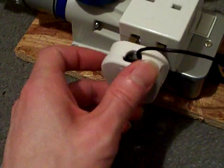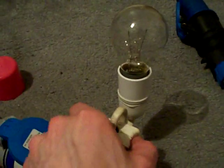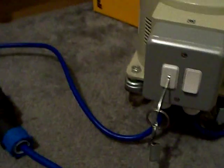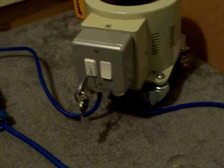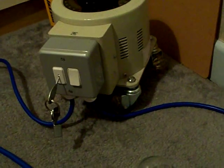The variac is on now. What I'll do is take our bypass plug and plug it in — that's now plugged in. That light bulb is now bypassed, which means I can remove it. Because the bypass plug is in there, that variac is now getting the top voltage and top current, and is ready for use. I can put a load on there without making any fuses or circuit breakers pop due to inrush. And that is how you start up a variac with a light bulb.